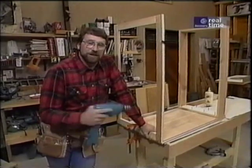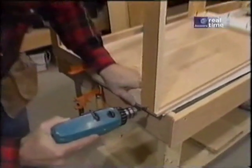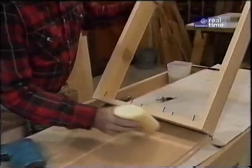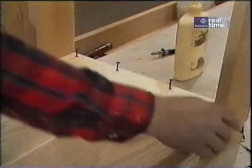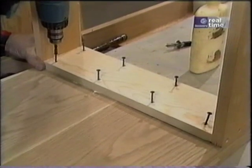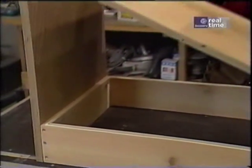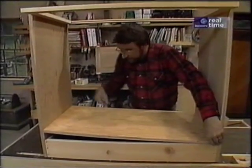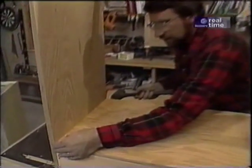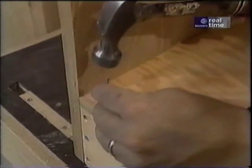Now we're ready for a little assembly of our dry sink. This is the top frame which gets fastened to the side by driving some screws through the top. On all these connections I like to apply a little bit of glue because it never hurts to add a little extra strength to the joint. Now this is the base we just assembled, and that also gets fastened with a few drywall screws. And now for the bottom shelf — a little glue, it's just a piece of five-eighths plywood. Drop it down in place holding it flush with the front of the side panel, and I'll just secure that with some six-penny finish nails — I don't want to really see the screw heads in here.